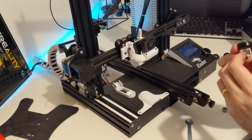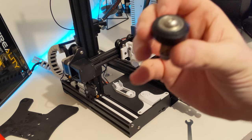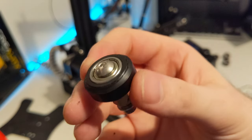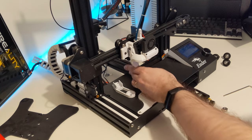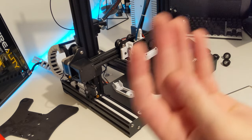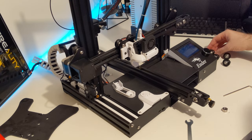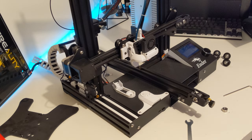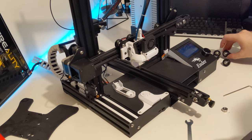The main reason I removed these wheels on the bottom is that if you look in there, you can see the wear and tear from the Y axis movement. This also gives you lots of dust in there as well, which can cause inaccuracy in the prints along the Y axis. They're all pretty badly grooved, so definitely worth replacing.